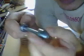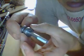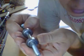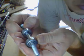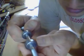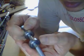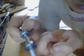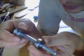If you want to clean them, make them dust free with a brush, a cheap China brush, and then put them in a glass jar with a lid with enough white spirit or thinner. Thinner is very degreasing and removes all grease and dirt. Then you just shake it and rinse it like that. Then remove the bearings again and oil them with the exact kind of oil or spray that is suitable for these bearings. You should use the correct kind. Don't use just any oil. That's what they say, and I think I should believe it. Then you can put them in the bearing housing, and the shaft can be placed.